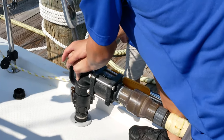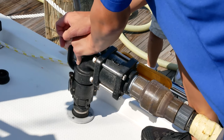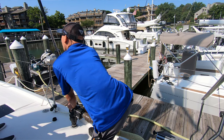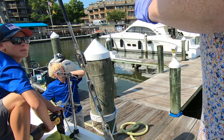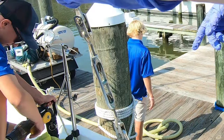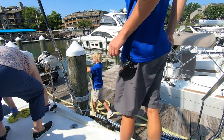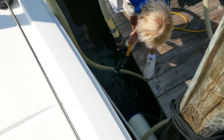Then you hold it there. There's a clear ball on the hose itself. As it's going through, if it's flowing, that ball will be completely full — maybe a couple gallons every 30 seconds. If the tank's getting lower, the ball will be maybe a quarter full. You'll still see some substance moving, but it's not going to be pulling much at all. At that moment, we'll close the nozzle, let it build pressure for a second, open it up, and it will cause a vacuum — it'll come up really quick. It's called popping it. Make sure you're holding it securely. We'll do that a few times. It helps get the stuff off the bottom of the tank too. Once we're done, the boat should be empty. If they have a second tank, we go to the second tank. Otherwise, we'll toss our nozzle into the water, pump up a few gallons to get all the waste out of our hose line, pack it up, and take it back to where we store our pump-out cart.